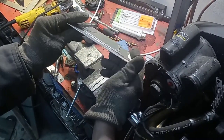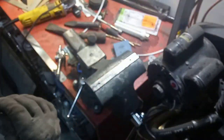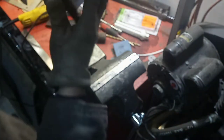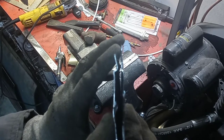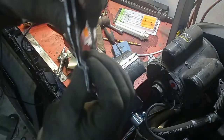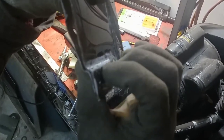So there you can see two of those flanges are in. Got to make sure they're deep enough though. Looking at that, I don't think I am flanging it quite enough. It's definitely not as sharp as the original. I can probably take something and stamp a little more angle into that, but I think it's deep enough now.